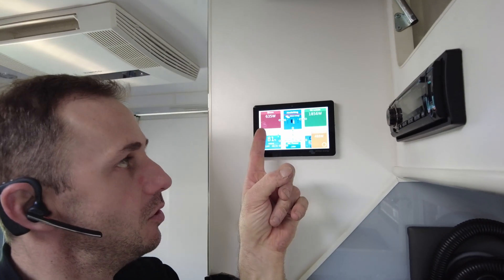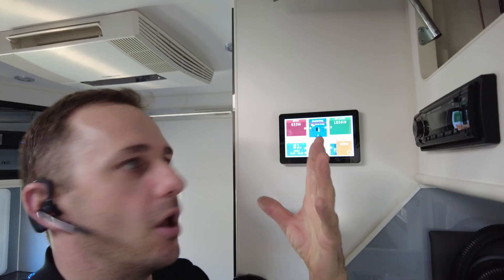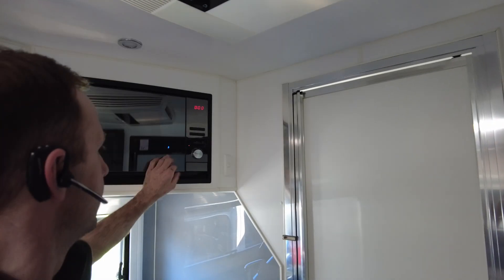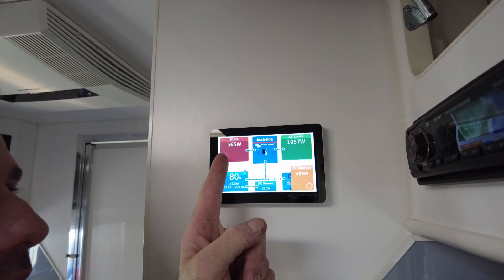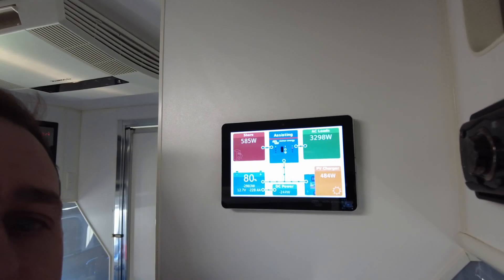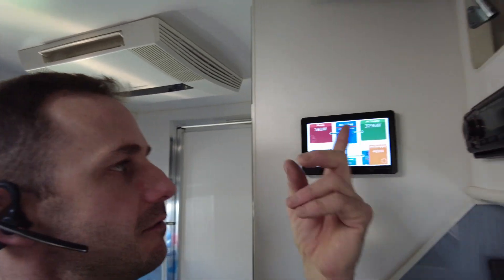I'll explain it. The current limit I've set at 3.1 amps means it's only going to pull 3.1 amps, also known as 637 watts. Now, if I was to increase that number, it'll start pulling more power, but nothing above that. And that's our load — we're running the hot water and the air conditioner. I'll put the microwave on — that's going to be really hot water. Microwave's on. Now watch the numbers — they'll increase here, but this won't change. It's actually got less. I'm pulling 3,200 watts now. I'm offsetting it — it's using 580-odd watts, 600-odd watts from the generator, and the rest is coming from the batteries. It can only do that with the Victron.